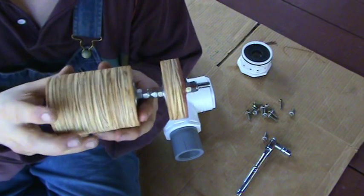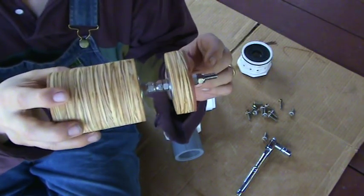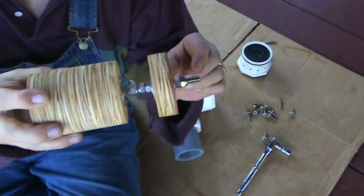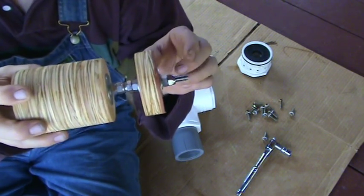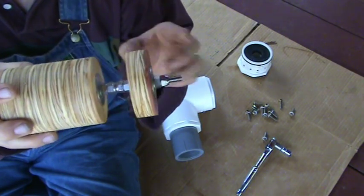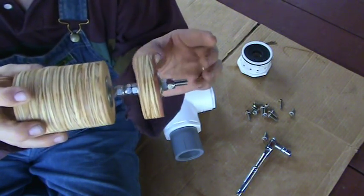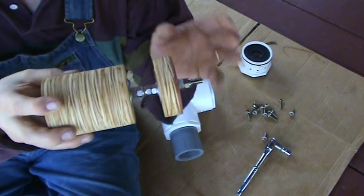Now, there's a theoretical rule that one quarter of the diameter — in other words, with a two-inch barrel, a quarter of that's a half-inch. Theoretically, half an inch is all I have to pull back away to get a complete air dump. I've got this adjusted out to about three-quarter. But as you can see, I could move this front one just by changing the nuts here to any throw I want, any distance I want within an inch or so. So I could try a half, one and a half — try different ones and see what performs better.